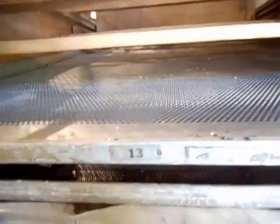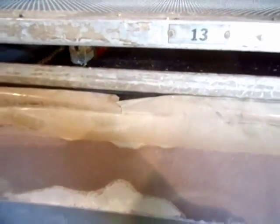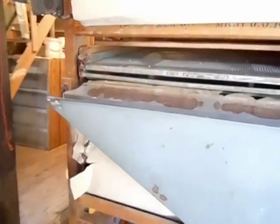Now we're using a 13 round hole for our number 1 screen. Number 2 screen is a 6/64 by 3/4. That'll take out your split vetch, anything smaller than the vetch. And we're just duplicating the process on number 3, and on number 4 is a 6/64 by 3/4. So now we will start cleaning seed and getting the unit set, and then we'll start taping again.